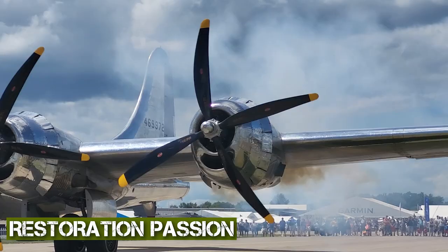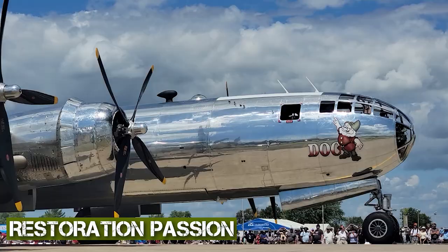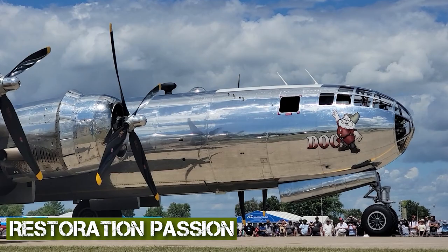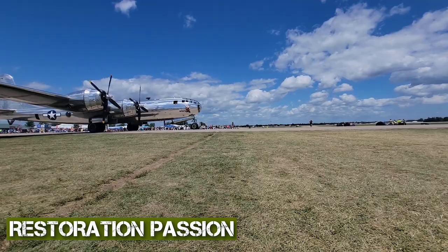2. Start giving some gas. 6. 8. Now that it's stabilized, we're going to bring the carburetor in and get the carburetor working. And the high-tech way you know the carburetor's working is when the fuel comes from the second source, it's going to flood the engine and you're going to watch the tach drop. So I bring this in, see the transition? That tells us the carburetor's now flowing fuel.